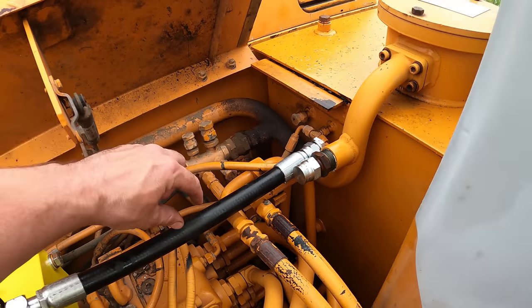So I ended up welding a plate on here, half inch, beveling it on all sides. The welds aren't that great, but I just got a new welder and I'm trying to get used to it. I bought a DC welder, so I'm running the 7018 rods. I'm trying to get it dialed in, but it's not easy because this is like 3 inches thick and this is like half inch or 3/4. So when you're welding on here, it's a totally different setting than welding here.